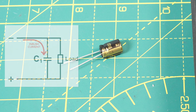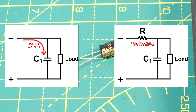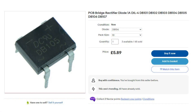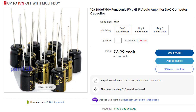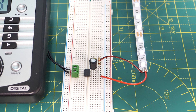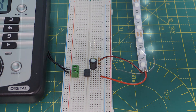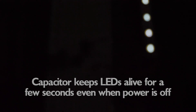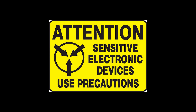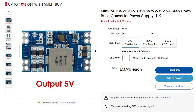Also if you're using loads of these capacitors on your layout then you might encounter something called inrush current when you first turn on your controller, as all the capacitors charge simultaneously. You can limit this current by placing a resistor just before the capacitor. In total the bridge rectifier and the capacitor cost around £1 from eBay, so it's a lot cheaper than the LM2596 — I'll put links in the description below. If this DCC supply was coming from track pickups and I connected a resistor and a strip of LEDs, you can see that we've got the basis for some simple coach lighting. But keep in mind that the voltage you get out will depend on the DCC controller you're using — one controller might give you 15 volts and another 20 volts. For more sensitive electronics we want to know we're always going to get the same output so that we don't risk damaging anything we plug into it, and that's where these buck converters come in.